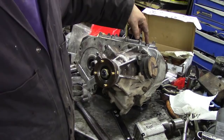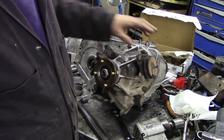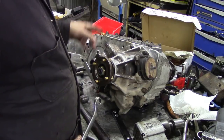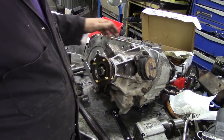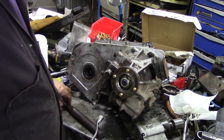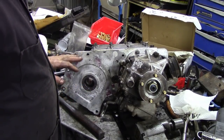Don't forget to tighten up the bolt for the bung - this one was loose. They put it in finger tight but it's easy done. Just get in the habit of tightening them back up again when you're done. I'm going to go around once the torque meter is set for all these 10mm headed bolts - eight millimetre diameter, eight millimetre threaded bolts - we'll do them all at once. I've put the sealing for the main shaft so that's done.